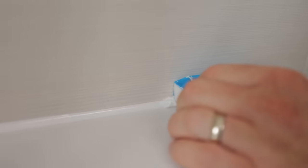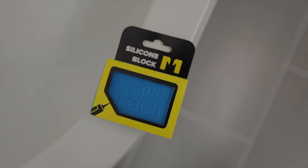Little blob, just in this bit here, because we've got a little bit of a problem. Always try and run it just there, like so. Start it off, bring it in, pull it along, and we've almost fixed that. Look at that. So there's the silicone block — add it to your siliconing arsenal, along with your finger, your squeegee gun, your blue roll, and any other formers that you might use. Nice tool, does the job, and I think they're only about 10 or 15 quid. It's on the Amazon store now, so you can buy them there.